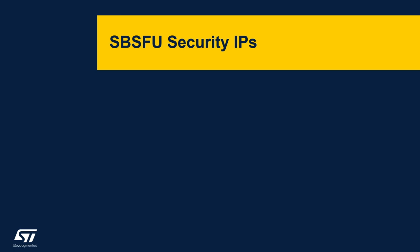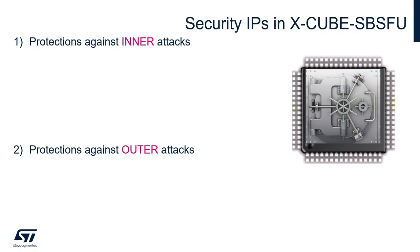How to make sure your root of trust is properly secured, and which STM32 hardware security mechanisms are used and combined together to offer the best possible security level in the X-CUBE-SBSFU reference code? The main goals of the STM32 security IPs are: one, to protect against inner attacks triggered by code running on the STM32, which may be due to malicious firmware exploiting bugs or security breaches; and two, to protect against outer attacks triggered by external tools such as debuggers or probes trying to access the device.